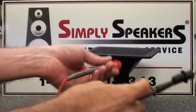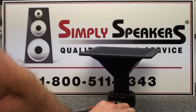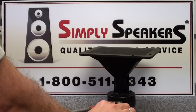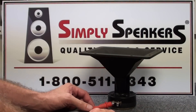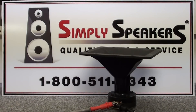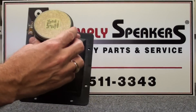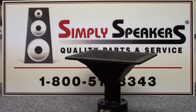The last thing we'll do is connect our signal generator at 2000 Hz at about one to two volts — we don't want too much power for testing, just enough to make sure everything works and sounds clean. If you don't have a signal generator, you can use a low-level music signal from your amplifier. We sweep the frequencies through to make sure everything is clean, and in this case it is — we're good to go. This unit came out of a community cabinet so we'll reinstall it. That takes care of the Fostex Foster D420 diaphragm replacement — very straightforward.